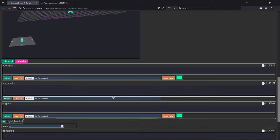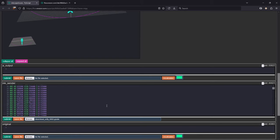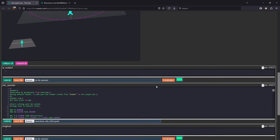Let's process our file. In InkSender, we want to open our file — we called it Steamboat Willie. There was already one here so let's grab the new one. You can see the G-code file and everything looks good. We also want to translate it — since we're six inches wide, we'll go X negative 100 and Y negative 300 millimeters. That's going to take our file and move it right in front of where we'll be facing. Let's hit Submit.